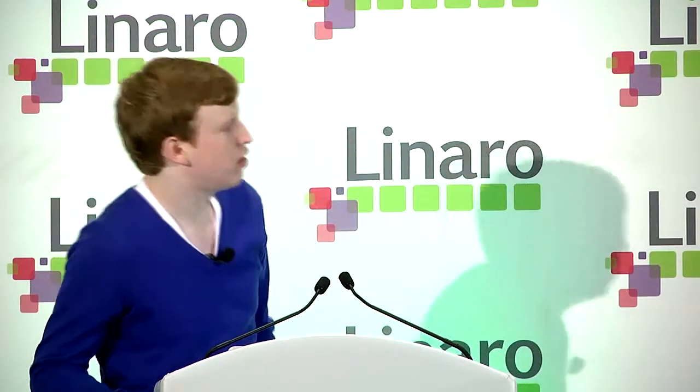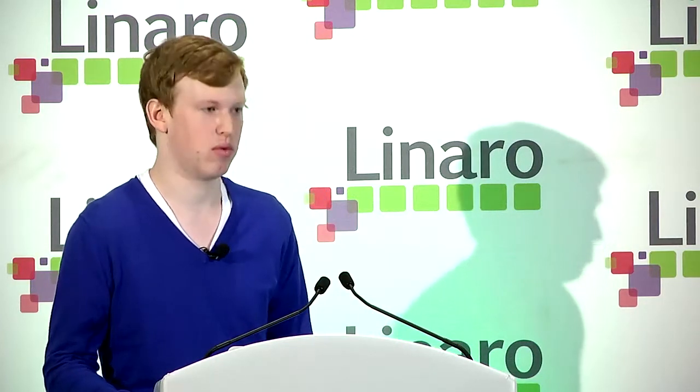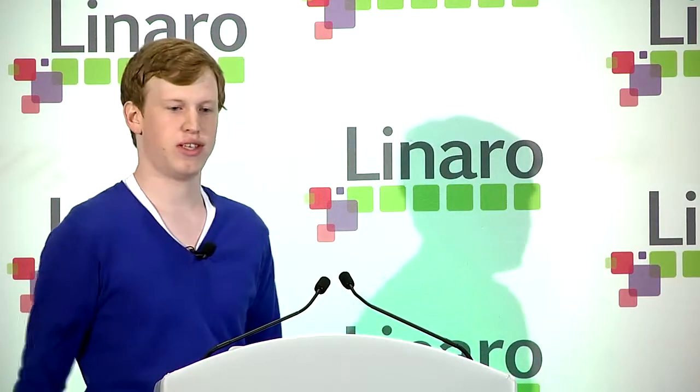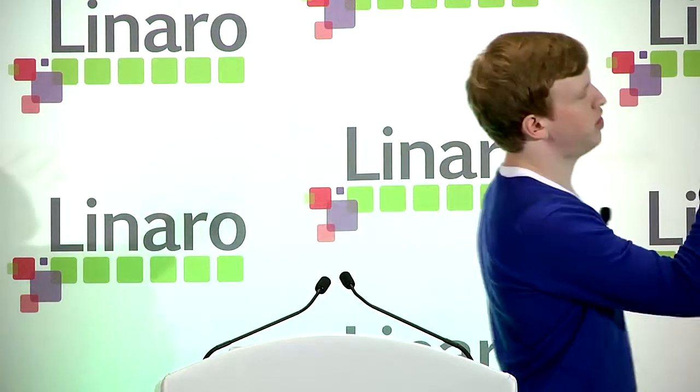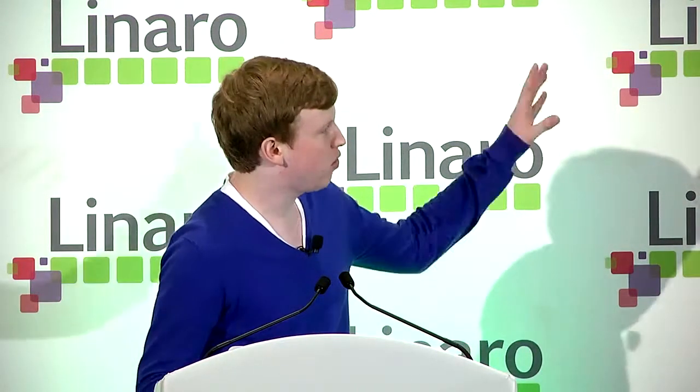At the back, which you can't see that clearly in this picture, there's a large, mostly empty PCB with a slight sprinkling of components, but on it are also 12 pairs of PCI Express slots. In these slots fit the EnergyCards, which I'll talk about a bit later. At the back you also have, for outbound connectivity, four 10 gig SFP ports, which is quite a lot, and a serial port to connect to your node 0.